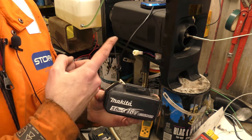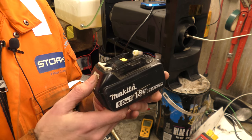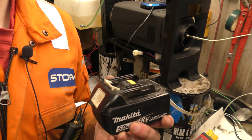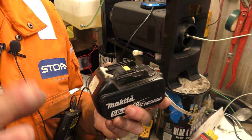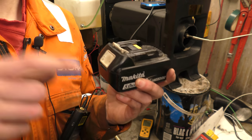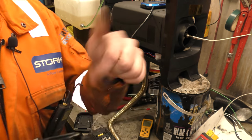So to answer the question: can you run a diesel heater off a drill battery at 18 volts? No. It gives error E02 which is the battery over-voltage error — the voltage was too high for it. We tried a module to bring the voltage down to 12 volts, but that was supposedly rated at 10 amps and died at 7 amps after a few seconds. If anyone knows where I can get a module that will do 10 amps or more, take 18 volts and output 12 to 14, please leave a comment below and I'll happily run this test again. As for 18-volt Makita batteries — no, it will not run in this guise. Thanks for watching.